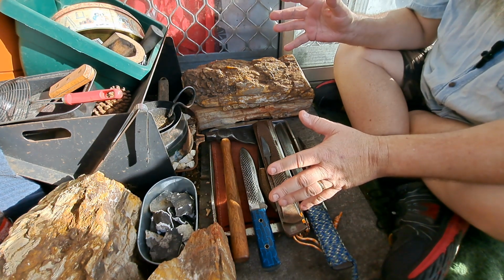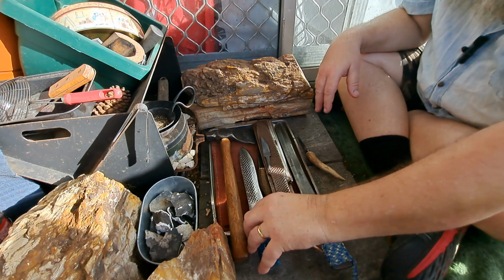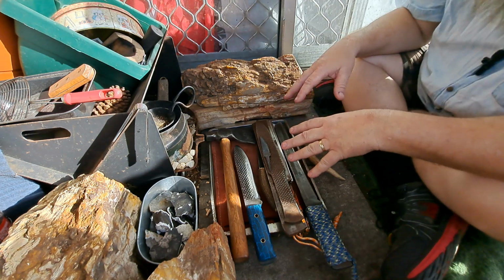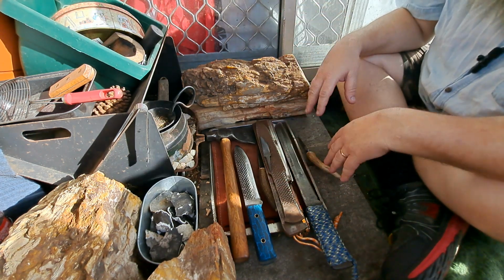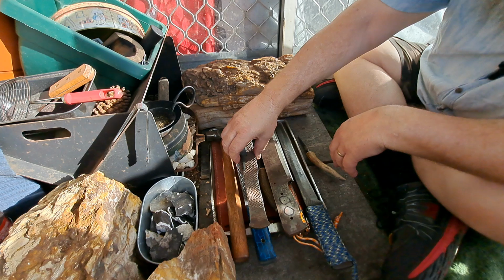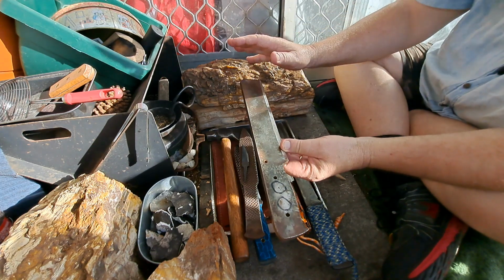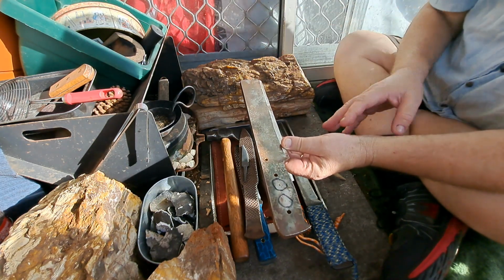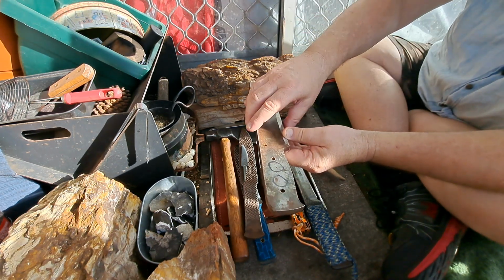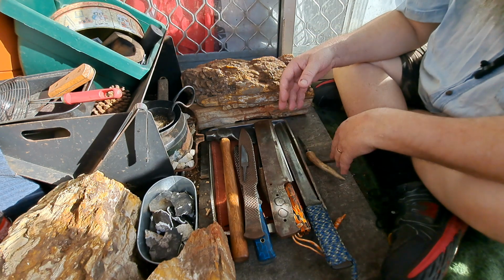Anyone who's been following my channel for a while will know I am no knife maker, and I do not like it per se. I find it boring because most of the time it is stock reduction. You get a piece of steel, whether it's an old file or in some cases a lump of stock. Then you just grind it out, which is called stock reduction. Grind it out, put it in the forge, heat treat it, and then finish grinding it, and that's done. There's virtually no forging involved in it at all.